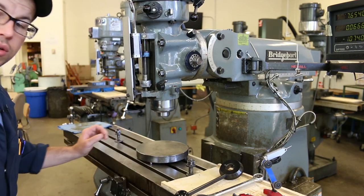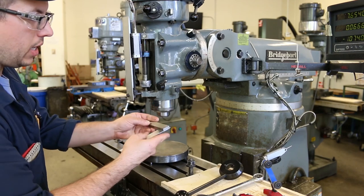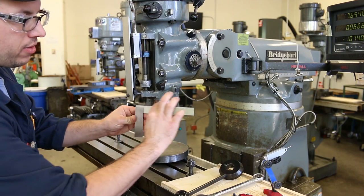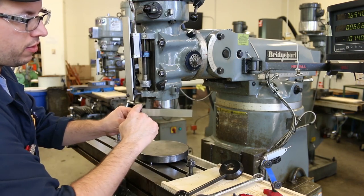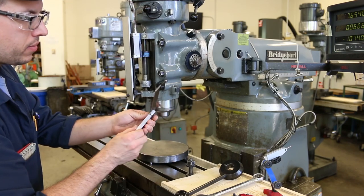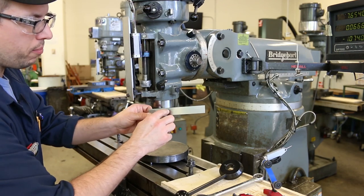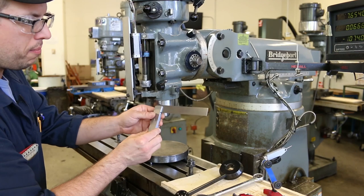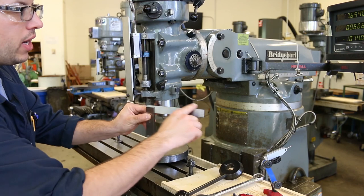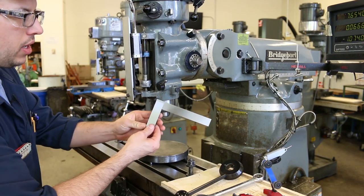So what we do is use one of these called a machinist's square, where it's a two-body construction. It has a blade. It's really like a straight edge. It has very, very straight flat sides, which are parallel. And then it's, I think, glued or welded or something, but permanently joined to this base right here, which is also super straight and flat and parallel. And they orient this surface on the blade very, very perpendicular to the base, right?